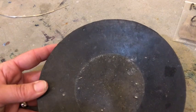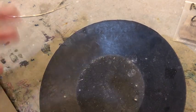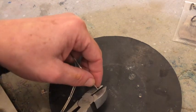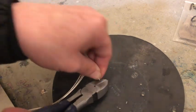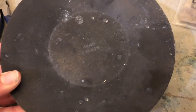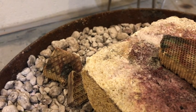One thing I'll check for is I'll clean off this particular holding cup to make sure it doesn't have debris, or other temperature solders, I don't remember what they are. And that's okay. I'm just going to dump that on the ground, shake that off, get rid of it. We only try to chip up what we think we're going to need so we're not wasting any. These little chips are called pallions. If you remember, you really don't need a lot of solder. You can take a look at the size of those. They're 1 to 3 millimeters long, pretty small. Okay, so now that we've chipped up our solder, we're ready to complete step 3 and do our solder placement.